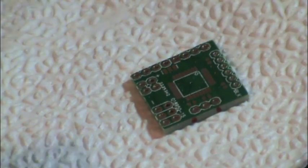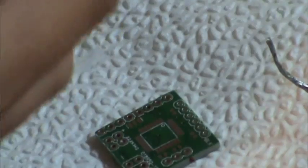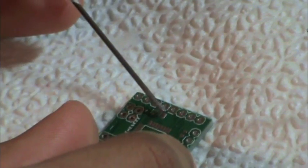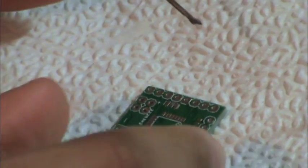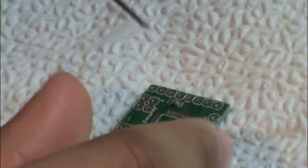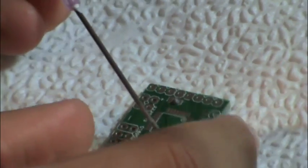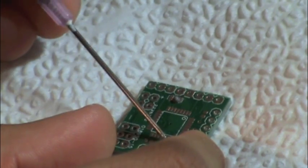I have this little toothpick to kind of spread the paste around. I'll try and get some paste on the end of this — not that much — and we'll just put that on our contacts. It doesn't really have to be that neat; of course you don't want any bridges. It will just come out like a paste, and there's a dab of it — we'll clean that up.